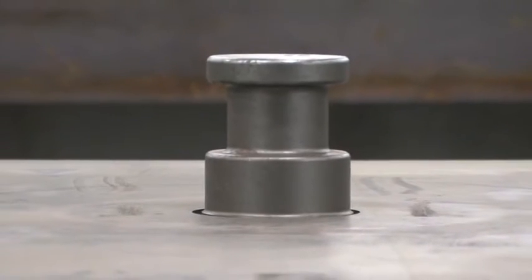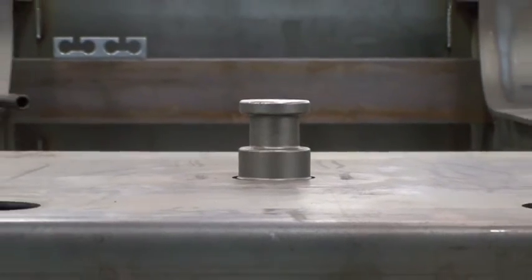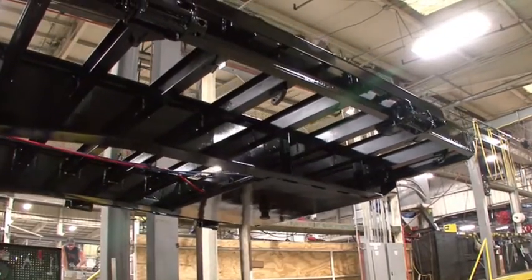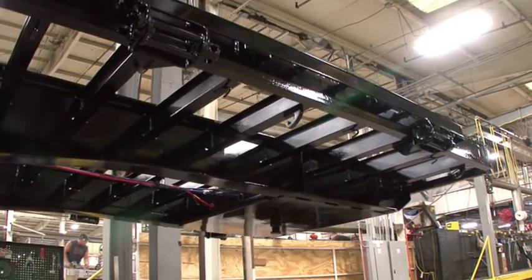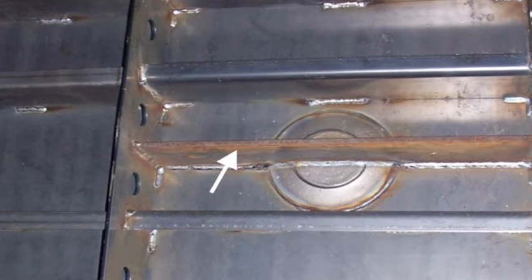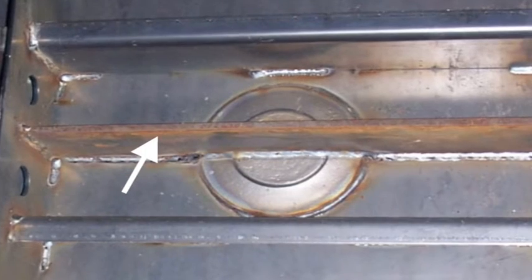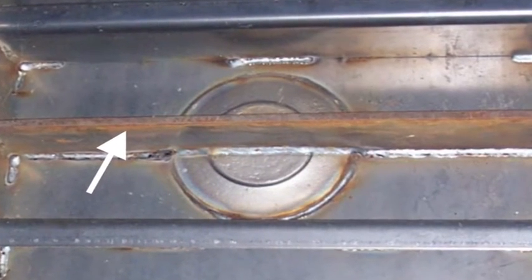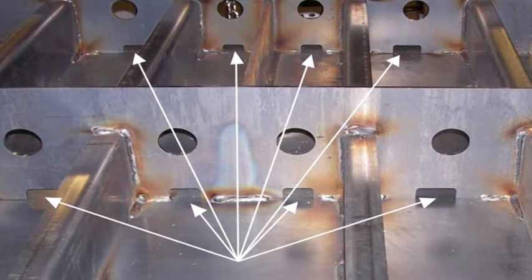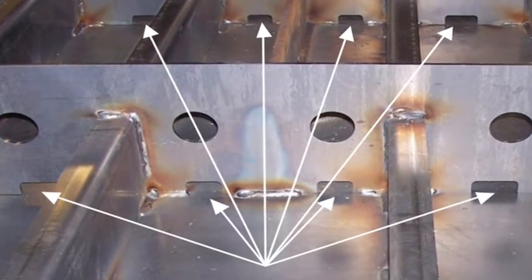The strength, design and durability of the trailer kingpin, kingpin plate and upper coupler nest is the most critical part of a semi trailer, since this is the only connection point between a truck and fully loaded trailer. In addition to fully welding the kingpin to the kingpin plate, an additional heavy duty longitudinal support plate is added above the kingpin and welded in order to provide maximum strength and support. The upper coupler nest and internal supports on the Velocity are designed for exceptional water drainage while minimizing entry of contaminants.